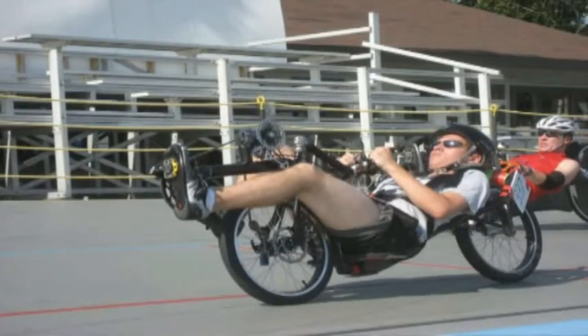So from those plans, I started thinking about the mechanics. I took the plans and basically tweaked the dimensions — there are a few things I didn't like, like the sidewalls weren't very high. The original plans called for the sidewall to be 15 inches. Looking at how I was going to put the pedals on the boat, it was going to be similar to a recumbent bike — where you're sitting back and your feet are almost at chest or abdomen level. I wanted to make sure that if I put the boat on top of the van, I'd have enough clearance so the bicycle pedals and whatnot wouldn't be sticking way out of the top.